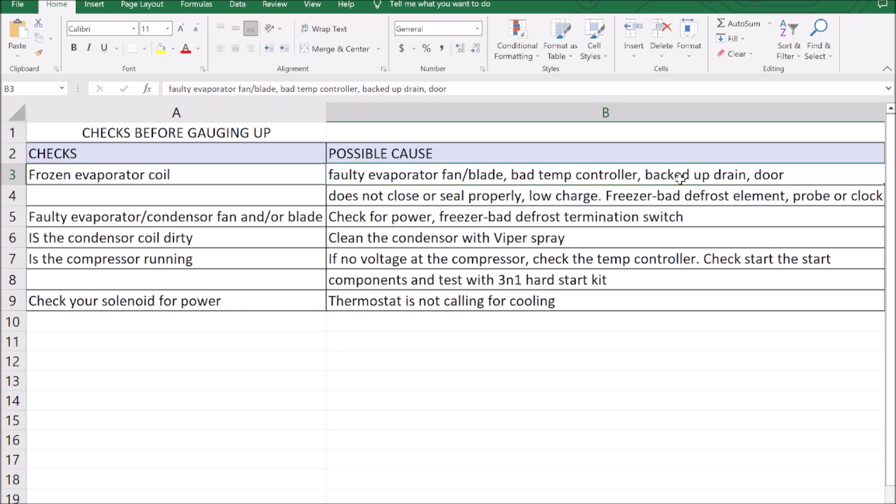The last thing is a low charge. I like to rule out low charge by adding refrigerant, but because we're R290, I'm not going to tap into this system — I'm going to go directly into a leak test. This system is so small I can do a leak test in about 20 minutes. If this was not R290, there's a good chance I would have put the charge back in and ruled in whether we're low charge or restricted.